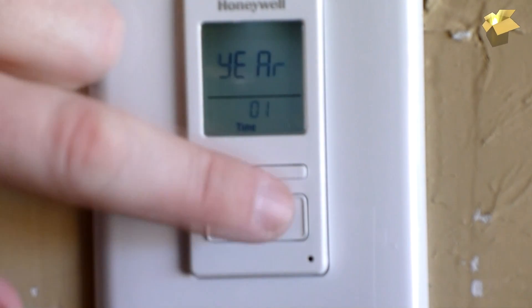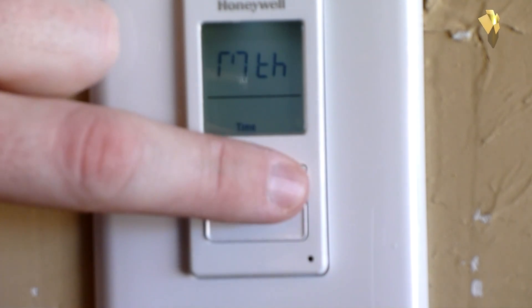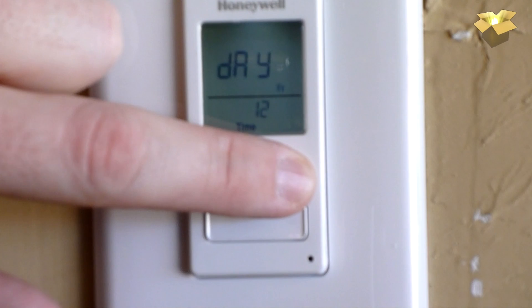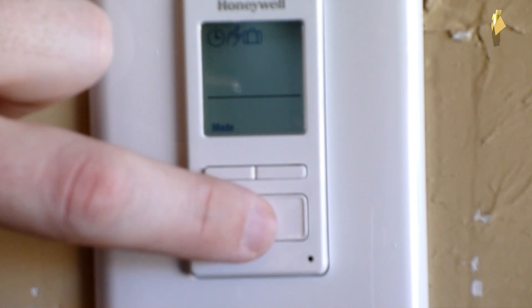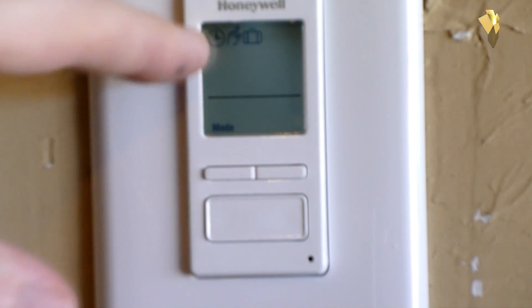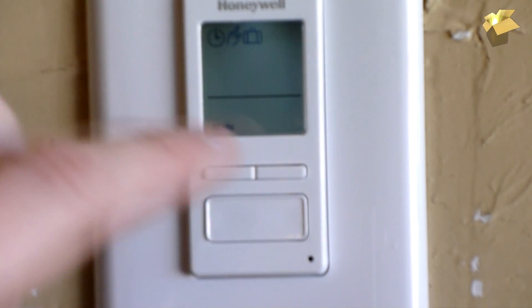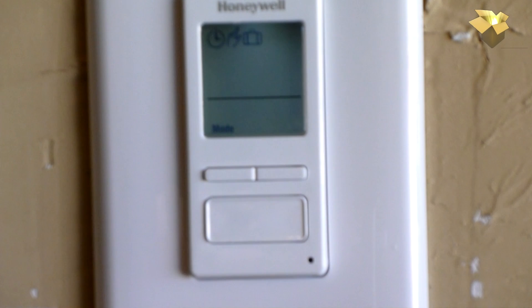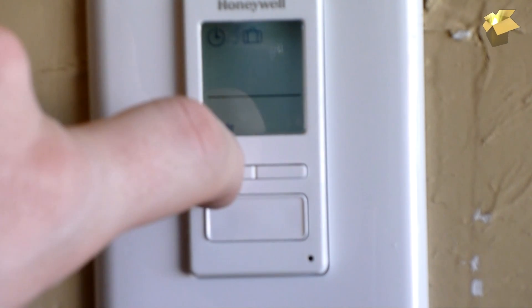Let's go to time and change our time setting. I prefer 24-hour time to avoid confusion. Right now it is 15:00. The year is 2016, month is February, and today is the 20th. Looking at the different modes: time mode sets on and off at a specific time; manual mode acts like a normal switch with no programming; and random mode turns lights on and off at unspecified times throughout the day — great if you're on vacation so people think you're home.